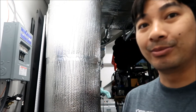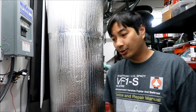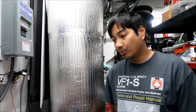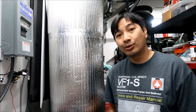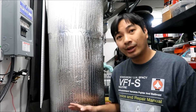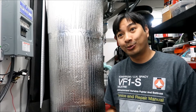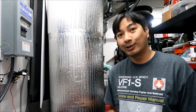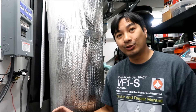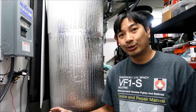I've been charging the battery and it's at about 2.7 volts now. When it gets close to 2.8 or 2.9 I'll plug it back in. Everything else is around 2.9 volts - number four was at about 2.5 and number eight is at 2.7. I'm going to charge both of those up to 2.9 volts and then plug everything back in and hopefully it'll work.